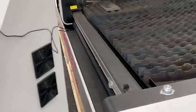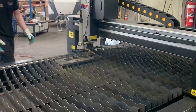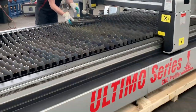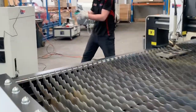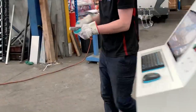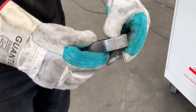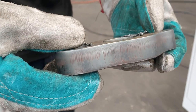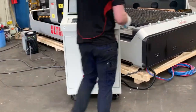There you go — we've just cut out a sample part from 26mm plate using our Ultimo series combination plasma and oxy. Look at the finish on this part — almost no dross to knock off. That's the general finish you can expect. Fantastic result — there's our Steelmaster plasma flame combo Ultimo.